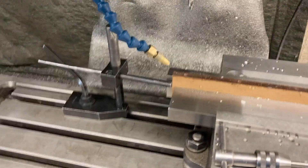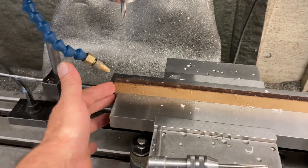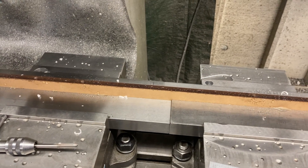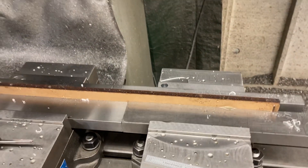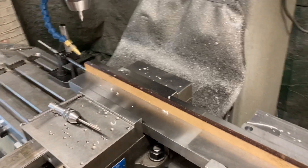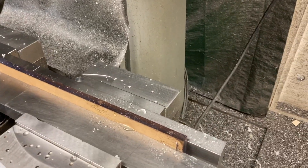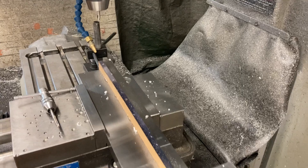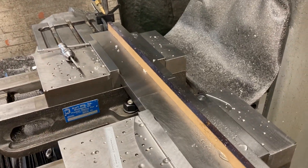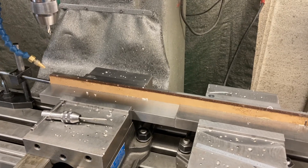You don't want to stop off the far end because if you've got a datum 750 thousandths in for the first hole, and your overall length varies plus or minus five thousandths, you're stopping off the wrong end. The 750 from the edge is going to change on every single piece from what the nominal number should be at 22 inches. So that's that — Titan Machine Tool, doing some fairly long parts. I did more talking than anything else but I just tried to explain my setup. Doing long wavy parts — banking both parallels, projecting that solid jaw almost the full length of the piece. Titan Machine Tool signing off.